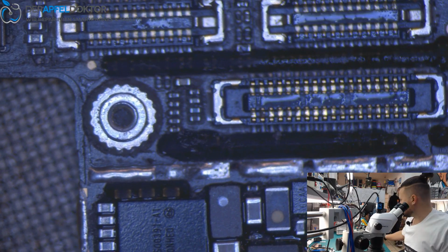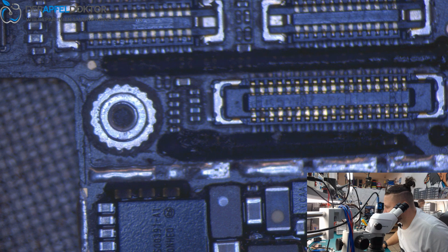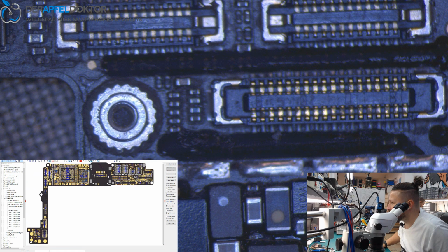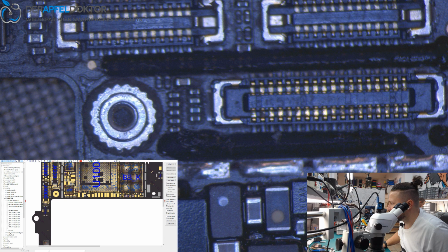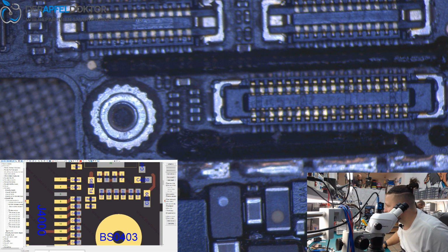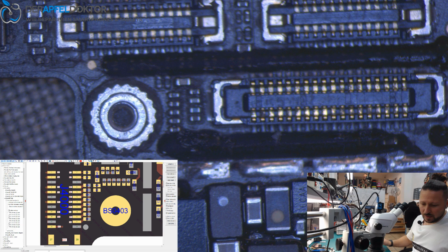I already did. So when we open ZXW here, iPhone 8 Plus, iPhone 8 Plus Intel, and now we choose ZXW here. Normally then you should see it. Let's see if we got some connector readings here. Otherwise we have to take another board for comparison. We don't have any connector readings here. Perhaps in the solution list, back camera resistance. Okay, we got connector readings here, so we take our Fluke or our multimeter, get it to diode mode,